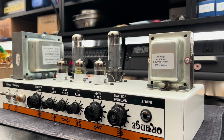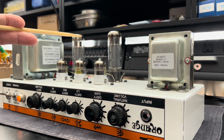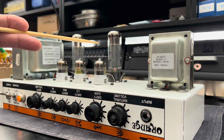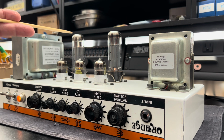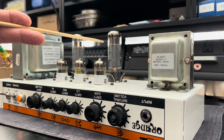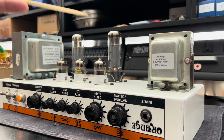All right, and we're back with the chassis removed from the cabinet, because that's what you got to do. So let's get her warming back up. So obviously not EL84s, we're looking at EL34s. Now, regardless, when I'm inducing some mechanical vibrations into the chassis via the cabinet or otherwise, I'm getting this distinct microphonic power tube sound. It could be a preamp tube.